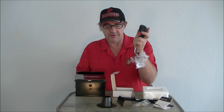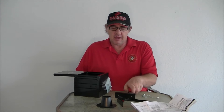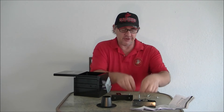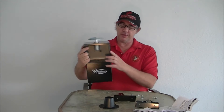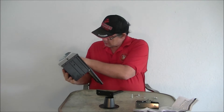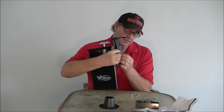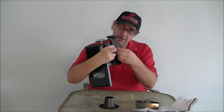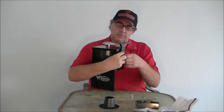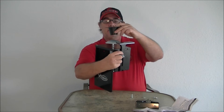Without further ado, let's get started and mount this to our barrel — or actually, it's a bucket. The first thing we want to do is find your two mounting brackets. You've got two bolts, two washers, and two wing nuts. Put one of the bolts through the hole on the inside of your mounting bracket, then a washer, then a wing nut. It's got a slot, so it's adjustable. They recommend a half to five-eighths inch from the bottom of your funnel to your spinner plate.